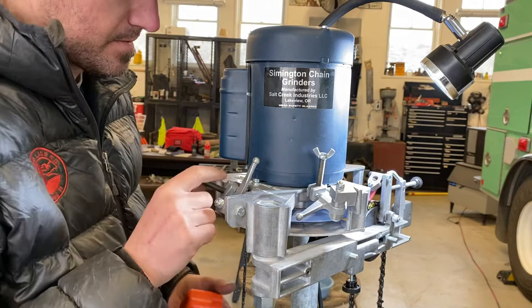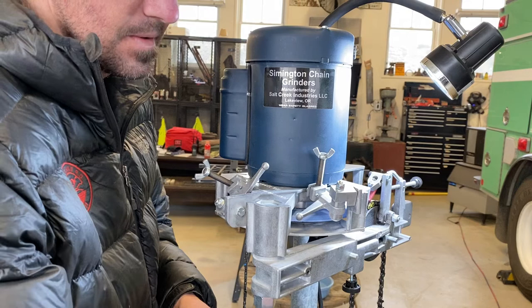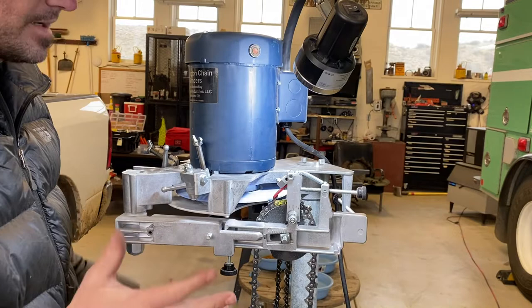Same thing with the side plate dresser — I'll lift it all the way up till it bottoms out and take a reading off the bottom flat here: 25 and a half. I'll put it back on my bench, zero it, recheck it — 25.5. So I kind of dial in my stone, and once I find the grind that I like I write those numbers down so I can duplicate it.